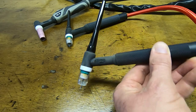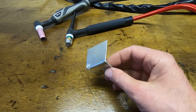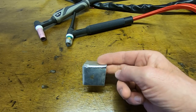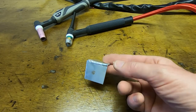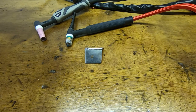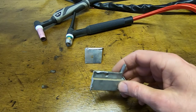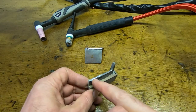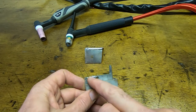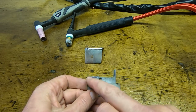And the next thing I do is set up to just weld some aluminium that's a bit thinner than the cross section that I'll be actually working on. Different process, I'm just here dialing in the machine. So once I've done that, I'll find a bit of very similar material with a similar wall thickness, and I'm setting up here just to do a quick run and try and dial the machine in so I can weld and add filler along the top of a narrow section wall without blowing it all away.